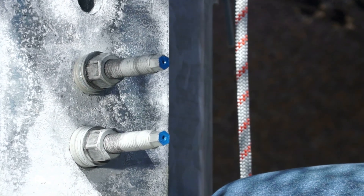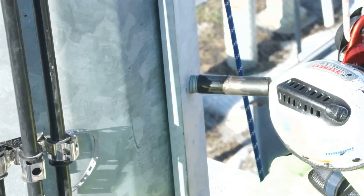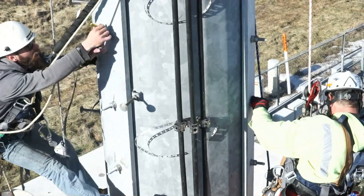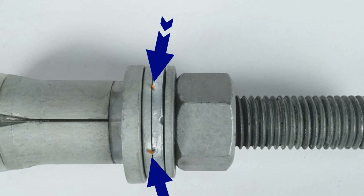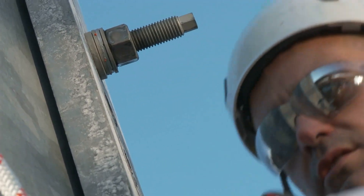There's no need for cold galvanizing touch-ups after installation. And achieving the optimum torque is no longer a guessing game. No more drawing lines, tightening, drawing more lines, and hoping that the torque is correct. With Forgebolt, paint-filled DTIs will pop when the bolt is properly torqued, giving you visible reassurance that the bolt is correctly set.